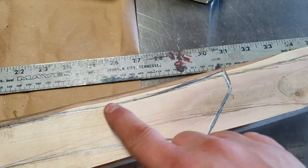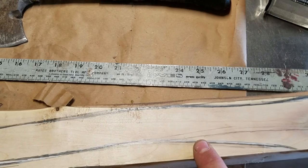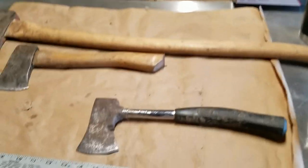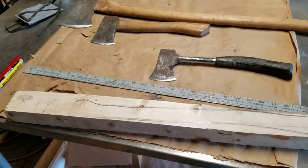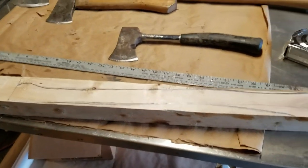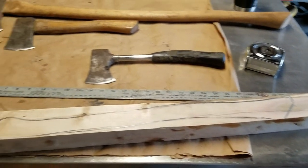We're going to cut this sap wood off and put the bell in — flare the end like both of the axes have — and kind of work the belly with the natural curve of the wood. Hopefully we get some grain line up. There's a little more knots in this than I would like, so maybe we'll be successful, maybe we won't, but we'll give it a shot.